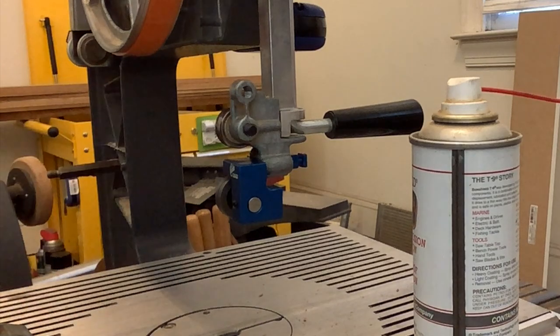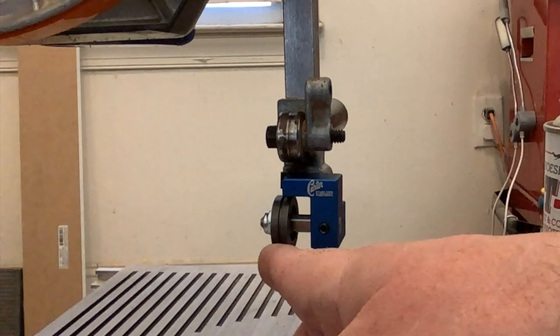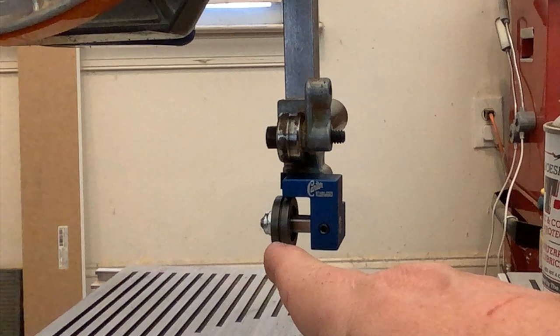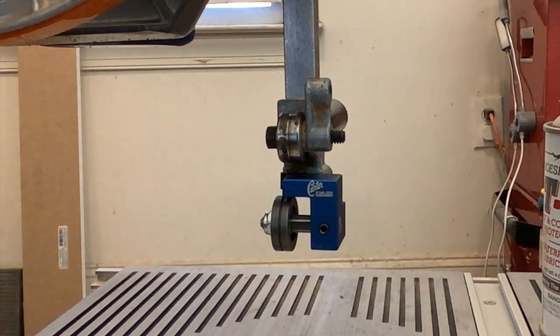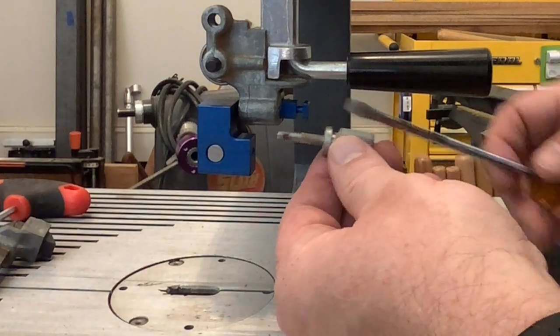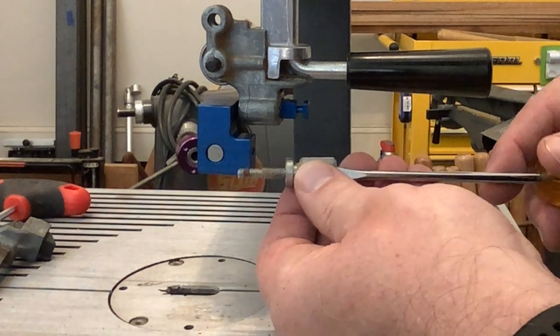with that screw. Now, maybe you see the same thing I do, and that is that groove in that top roller ultimately will need to be centered where the blade is. And that's what that set screw there is for. We're going to be able to loosen this and slide that over. But for now, we need to reinstall this little fella. You can see right now that this screw and that knob are nowhere near the proper alignment. So I'm going to back that screw out.